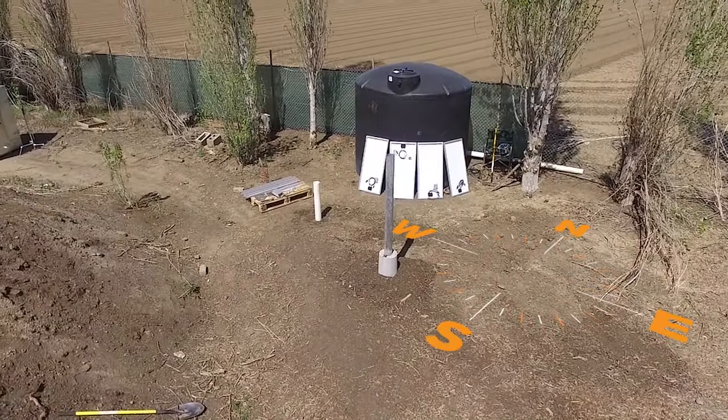Now let's talk wire management. Most likely if it's a very short distance, you're going to be able to get away with some flexible conduit to run your pump wire and low well sensor through and up over to your controller. If you're going a longer distance, you'll want to either direct-bury your wires by digging a trench, or install conduit and pull your wire through over to your controller. You're also going to want to fence off this area if there's livestock — I can't tell you how many times we get a phone call that livestock chewed up the wires. Now everything's hooked up — let me go ahead and fire up the controller and see if everything's working properly.